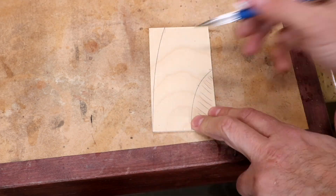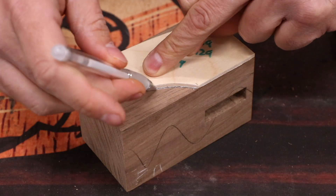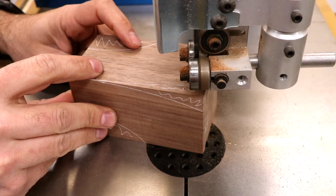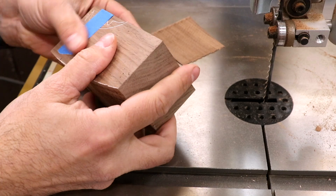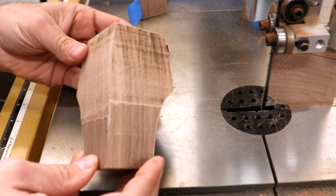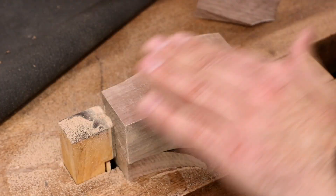For the feet, I'm making up a little template based on what looks good to my eye — there'll be an outside curve for the front faces and a small inner curve for the inside faces. The shape is applied to the two outside faces of the leg blank. Before making any cuts, bring all four feet together for a sanity check. I like to start by cutting both curves on one face, then taping the off-cuts back onto the blank to cut the other face. At this point there are no more flat reference surfaces to work with, so I'll finesse the feet at the spindle sander by holding them up, applying pressure, and checking progress repeatedly. At the workbench I'll finish sanding the feet, including all the curves and flats.